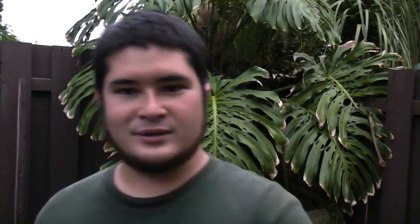You're also going to need a three-quarter inch schedule 40 pipe — doesn't matter if it's conduit or not — this is going to make the handle. One thing I like to do, especially if I'm going to be painting this, is I've gone ahead and completely sanded both pipes. I've taken all the lettering off and roughed them up nice so that the paint will have a good surface to adhere to. I've also gone ahead and rounded the edges on all of my pipes just so that there aren't any sharp edges and everything's clean and finished.